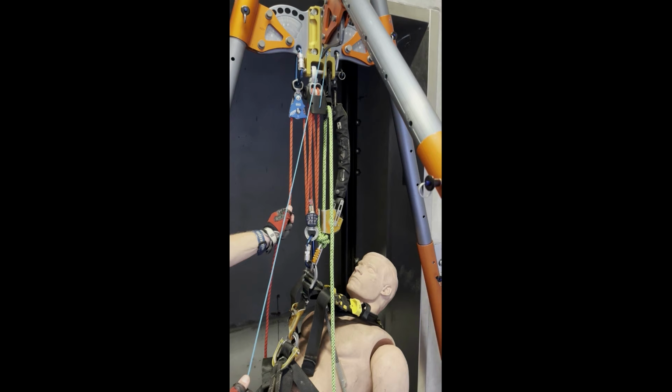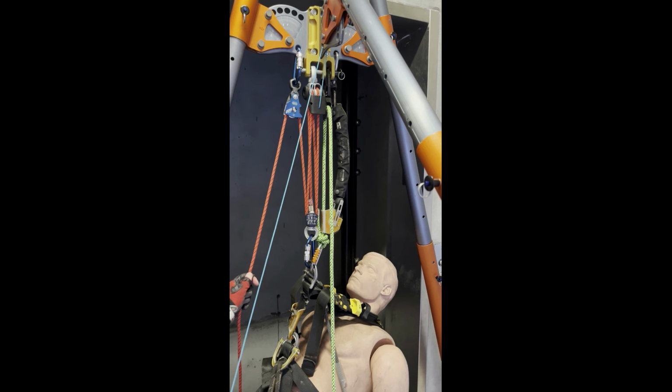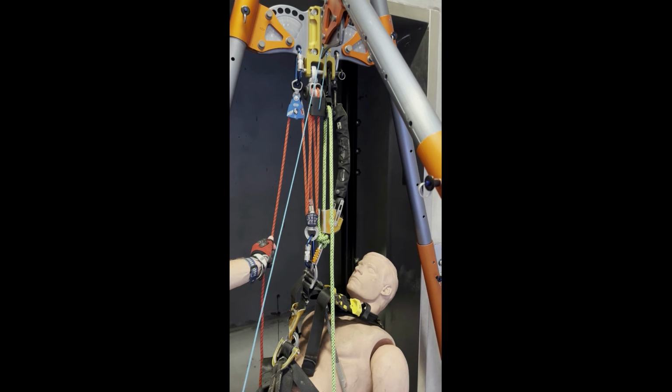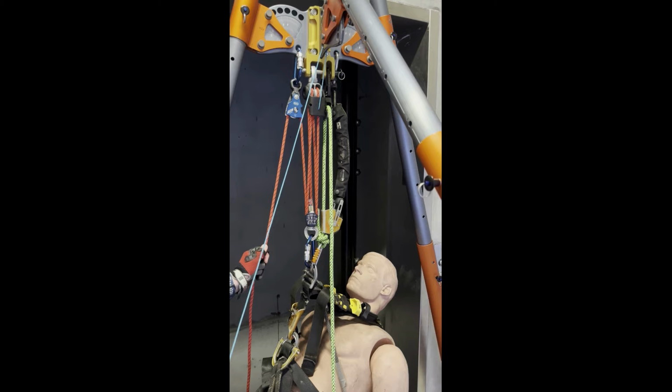So the reason why we did that with the 250 feet of rope is we wanted to maintain that 50 foot distance, right? So a lot of the haul safes you have out there in the market now, they're 200 feet of rope, but they're in a 4-to-1 configuration. So you can see this guy with our handle up top is we want to have this in a 5-to-1 configuration with the COD. So we have 250 feet of rope, but we actually get more MA out of our system as well.